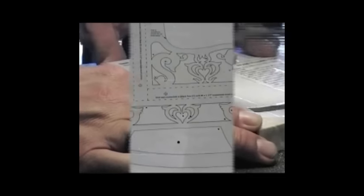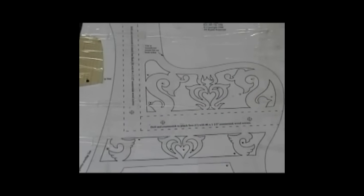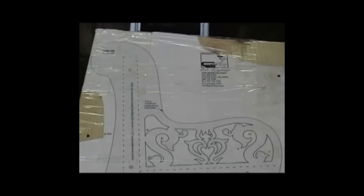Now that our tension-filled issues of wandering are cured, we'll finish cutting the chair seat with the scroll saw. This pattern will be just beautiful when completed. When doing this kind of work, always try to make the inside cuts first. I typically like to start at the bottom and work my way up through the project.